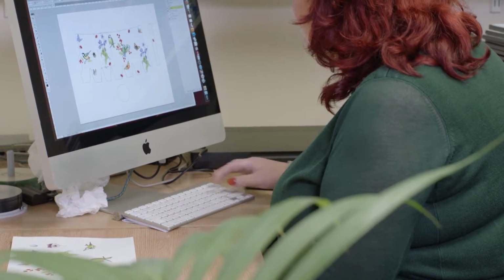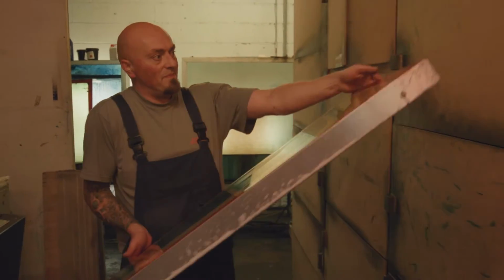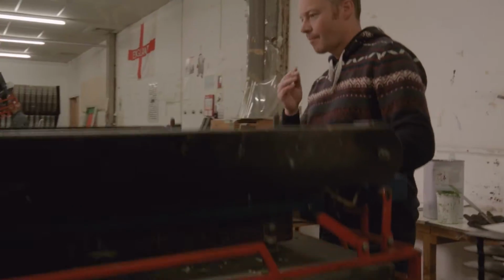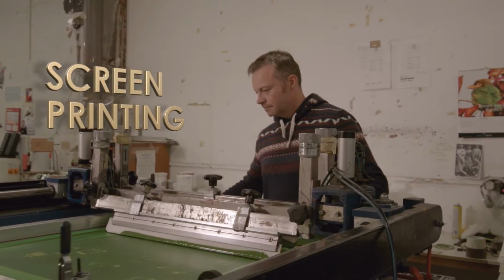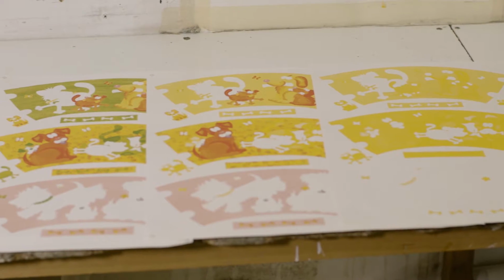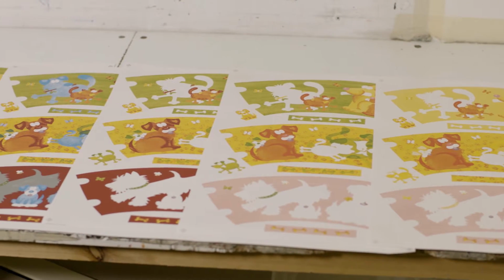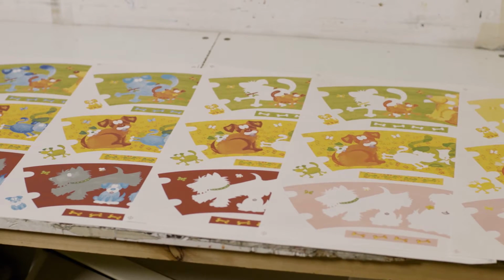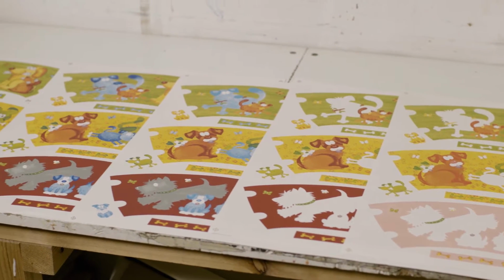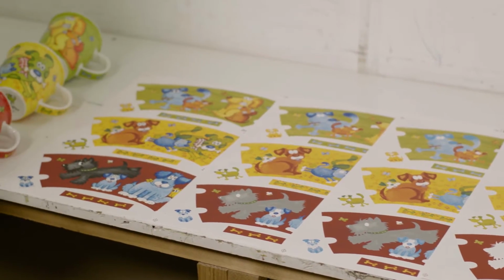Using computer software, these hand-painted designs are separated into various colours, ready to be screen printed. Effectively, it's taking the standard screen print process, adapting it using ceramic enamels instead of standard colours, so that they can be applied to all sorts of pottery, earthenware, china, etc., different shapes, which are then kiln fired. We have about 9 colours in this design. It's usually starting with the lightest colour, so we have a yellow, then we go on to an orange, then we go on to a red printing, then there are the 2 stages of blues and greys, gradually building up to a black being at the end.